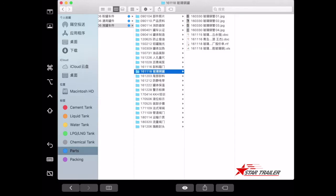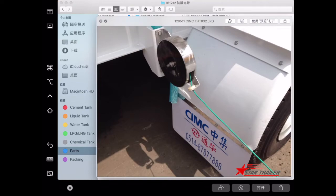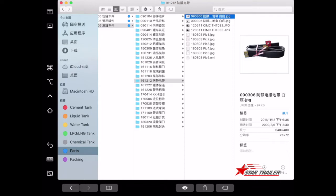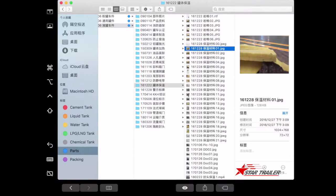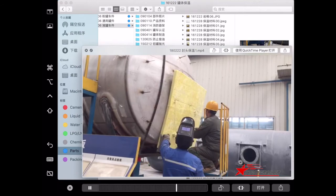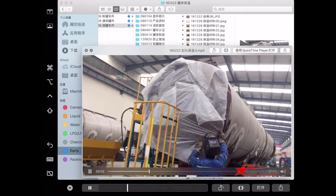These are fiberglass spare parts for fiberglass tanks. This is the anti-static electrical device — you need to release static electricity from the tank body periodically to prevent fire. This is the glass wool temperature-keeping material placed between the tank body and the outer shell, to keep the temperature inside. This is how we apply it in our factory, using those spare parts and other materials to cover it.